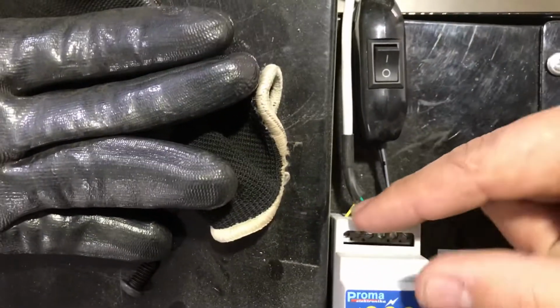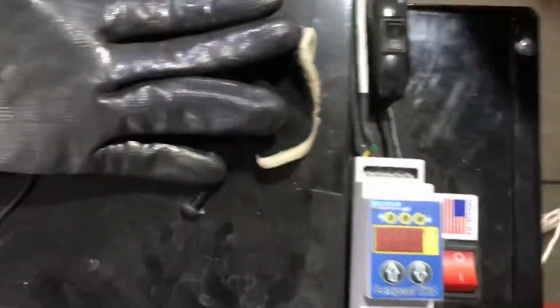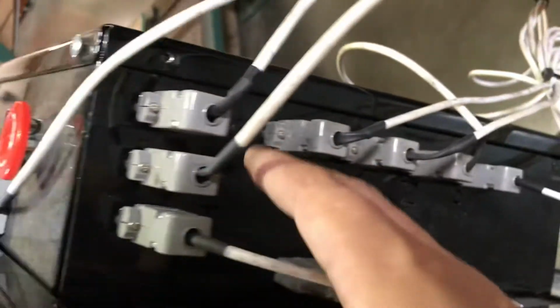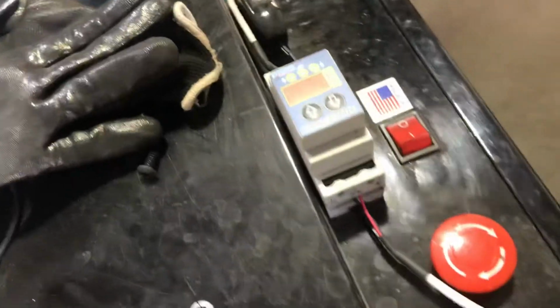We like that. And then this other cable here coming off the backside with these pins here, yellow, green, red, black. They all go to the T port on the torch controller on this box here. So the T port here, down at the bottom, let's see if we can get a better shot of that. The T port right there. Then of course the plasma gets plugged into the P port, but let's go ahead and walk over to another machine, an actual plasma cutter here, and show you where all those get plugged in.